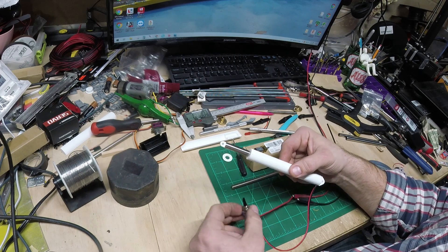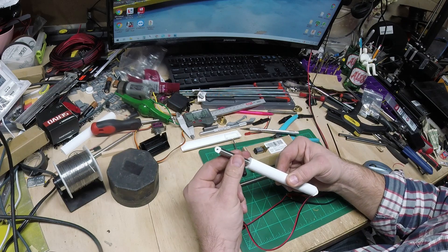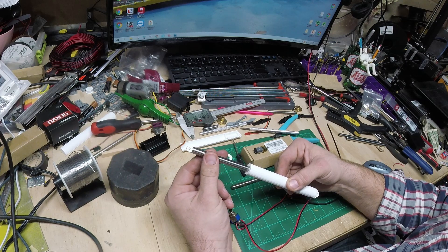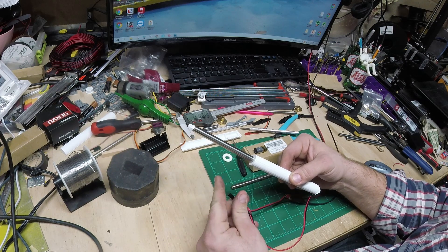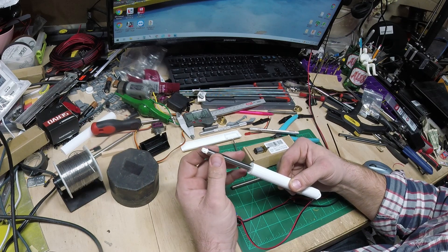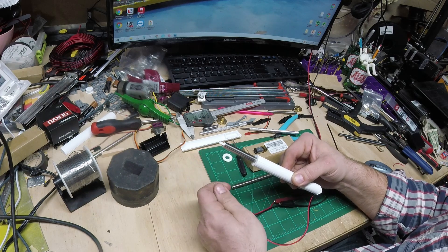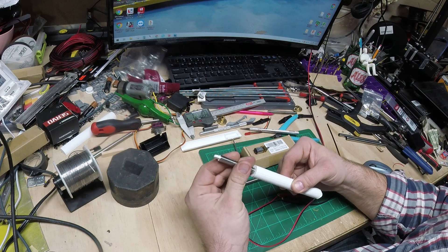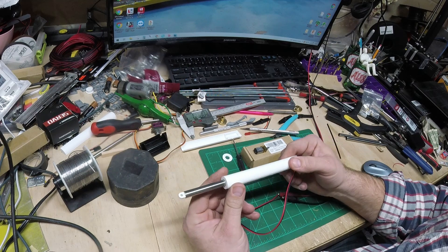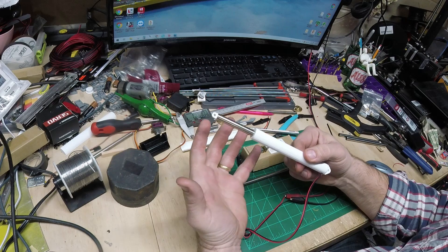Let me just demonstrate it first. I've got it wired up to a simple double-pole double-throw switch that I can use to control the direction. So we have the cylinder that would extend. I currently don't have any limits in it, so I'll retract it. You hear it bind when it gets to the end of the stroke a little bit, and it's going to bind when it gets back to the beginning. I'll go ahead and turn that off. When there's nothing in there, you can actually see this rod spin, which is pretty typical to most electric actuators.